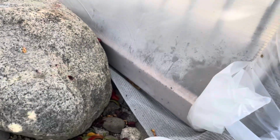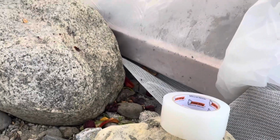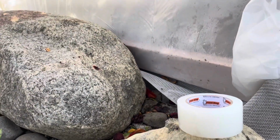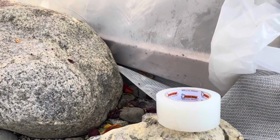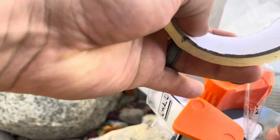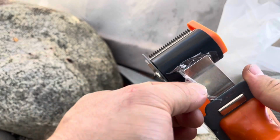Let's go on the outside, see some holes, let's tape them up. This thing's got to be airtight. It's just basically a skin, and the laws of thermodynamics are working against us. When it's 30 degrees outside, you're just stopping the air movement in, but you can't keep that 30 degrees out for long. So you might need to go from a passive to an active situation in that case.